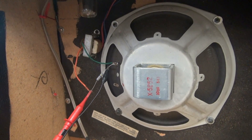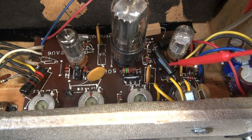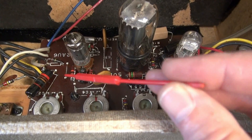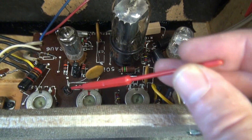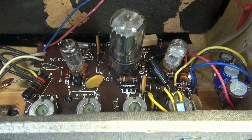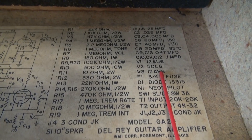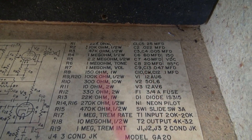The filter cap made a big improvement, but I think we've got more bad caps. So the next step — you can see we've got some old black beauties here, and they've got to come out. They're notorious troublemakers. Also, there are a lot of resistors in here with no tolerance bands on them, so I'm going to need to double-check those, and any that are out of tolerance we'll change. The biggest bonus of all: not only do you have a schematic, but you've got a parts list too. So when you can't read the color codes on those caps, it's marked on the board — look it up, grab the value, gather your parts.